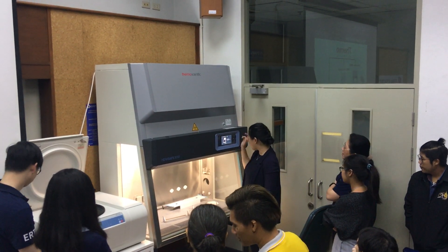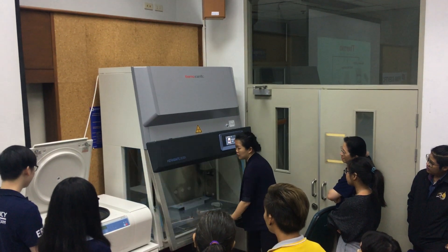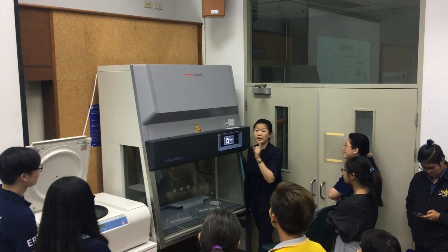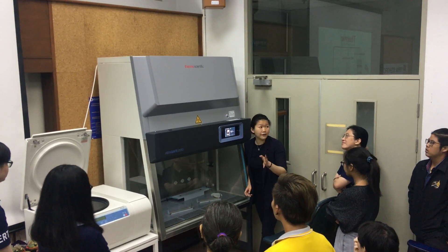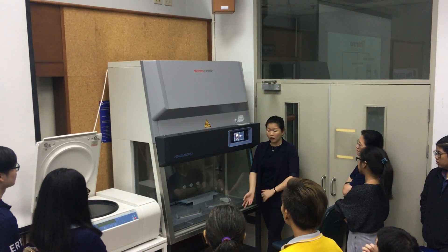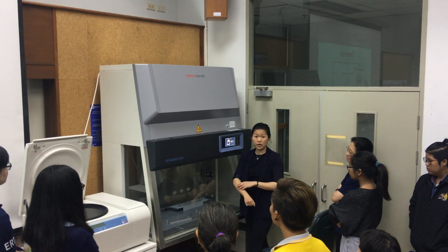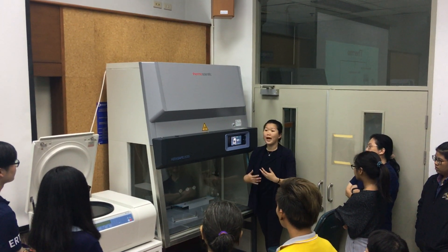So I want to try the UV — I don't know whether I've activated it already because today this is new. Let me try the UV. Yeah, it's on — the UV went off. 'UV disinfection cycle has been disrupted — restart or return.' So there's a safety interlock. Same thing for the unit you have — if you accidentally open the sash, it will have an interlock. Your unit needs to have a safety interlock. Not that people would die from UV right away, but if there's no safety interlock and the UV is on with just a little gap, somebody may not notice and get long exposure. So please make sure you have that safety interlock.